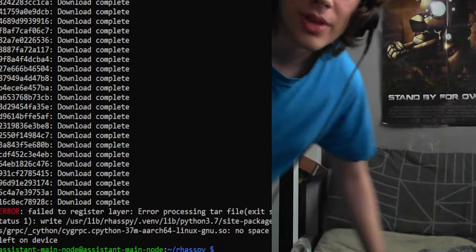I tried to flash Pi OS first to my 32GB microSD, and then that was how I found out that microSD is broken. Eventually I did manage to boot into Linux with it, but transfer speeds were really slow, both on the Pi and while flashing Pi OS to it from the computer. Accessing files would often fail, but not always. It failed to boot multiple times and then eventually got me to a boot screen. So then I tried my 4GB microSD, which was fine until I actually needed to download anything and I ran out of space. I thought I'd just be stuck until I remembered you can boot modern Pis over the network, NVMe, or also USB drives. So the USB drive won't be staying with us because it's physically massive — it's just a 16GB one — but it works for testing.